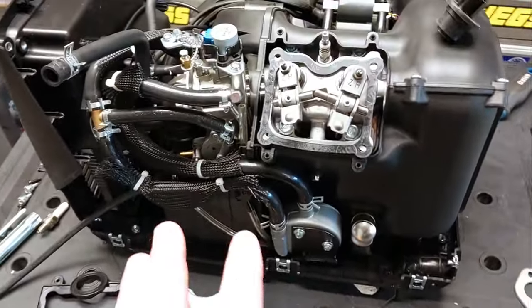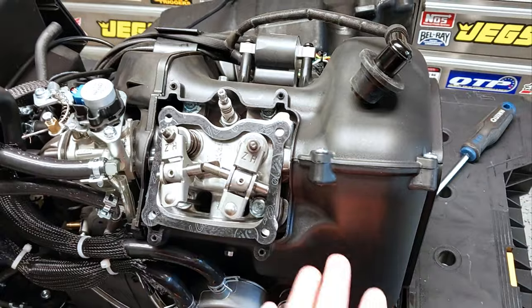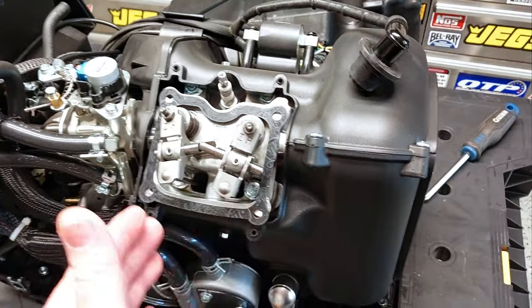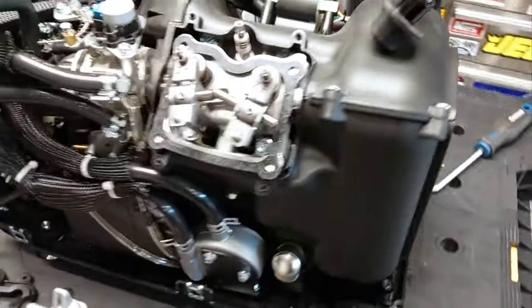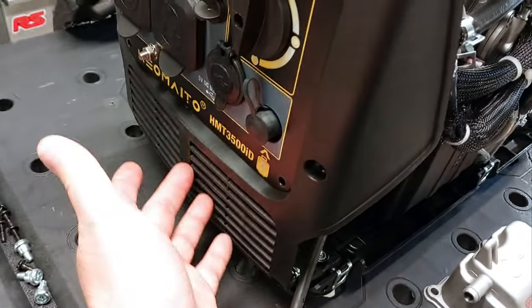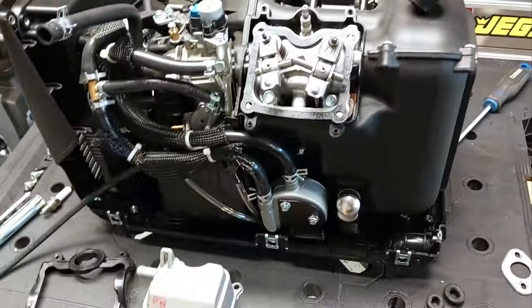One thing of note, the way these generator assemblies work is they've got a fan in the front here. And that fan sucks air through this plastic case. You notice the motor and the generating assembly is all encased in plastic. That fan sucks air through the whole assembly, blows it out this exhaust piece, and actually cools everything. It cools the motor, cools the muffler, it cools everything. So the thing really doesn't catch on fire with how much it's crammed in here. Also, that's why all these generators have this venting up front: they're drawing air through the assembly, over the heat sink of the inverter unit, and then through the engine. So I just want to make sure you understand how that works.